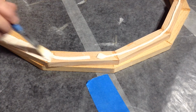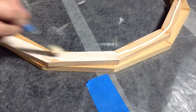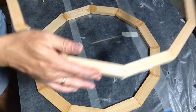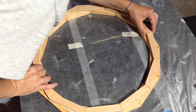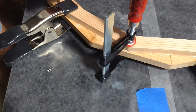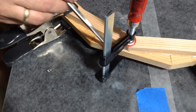So, the reason I have 2 different widths for the rings is so I can glue them together. I just wasn't comfortable with the miter glue joints holding over time, so I am sandwiching the 2 rings together. The rings are rotated so that the joints overlap solid cedar. After clamping these together, I cleaned up the excess glue by scraping it out of the corners with a chisel. The more band clamps you have, the quicker the process will go, as you can have several rings drying at the same time. As it turned out, I had some spare aluminum on hand and didn't need the U-channel I had purchased, so I returned it. That brought the total cost of these spider frames to less than $8.